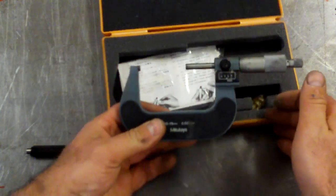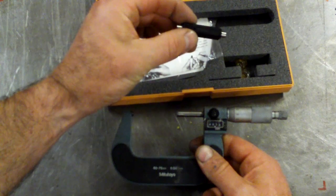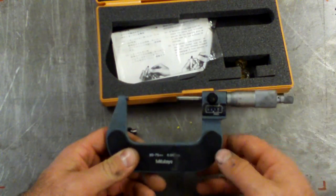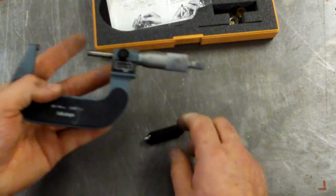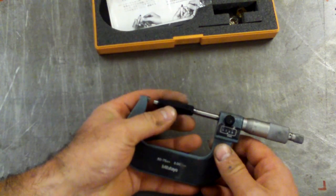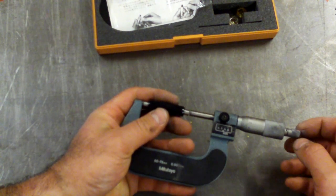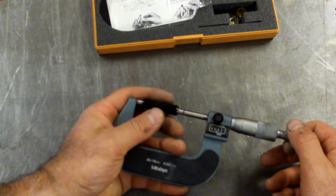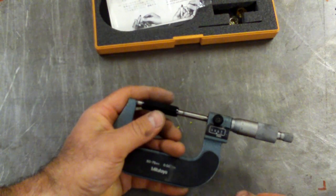So let's quickly talk about how you might use this guy. This is the calibration scale out of this particular tool. So I'm going to just take this out past 50, 51.1. You know, sometimes you need 3 hands to do this job properly. Hopefully it's on a part that's stable on your bench and you can measure it. So I'm just going to hold it there, and I'm going to gently turn that down. Okay, so I've got 50.0 halfway between 2 and 3.